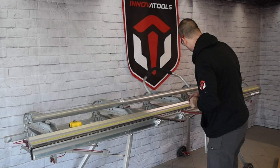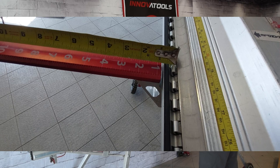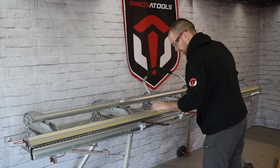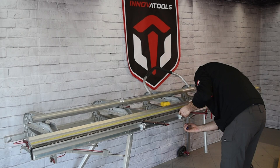Take your measuring tape and line yourself up on the stainless steel when the brake is locked in, then line up your measurement. One inch and ten inch are lining up. Put just a little bit of pressure on top to make sure it doesn't slide, snug it up, twist it sideways, and then crank it in place. Repeat the same for the other side — line yourself up; that one is bang on as is. Tighten it in place.